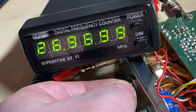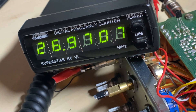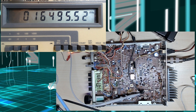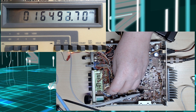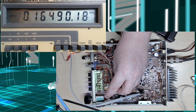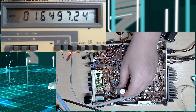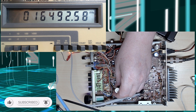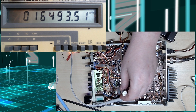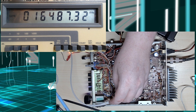So let's get that transistor soldered in and realign it yet again. The shift's working correctly now. We go back to the same test point TP3 and adjust those coils. Channel 19 band C, mode AM/FM, adjust L14 for 16,490 which is TP3, lead of R73. Then select USB and set to 4925, then LSB which we're going to do on 4875.